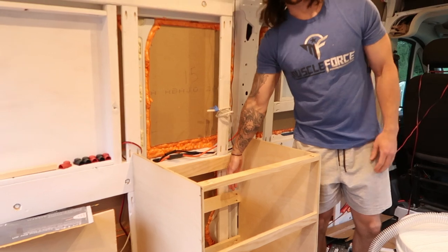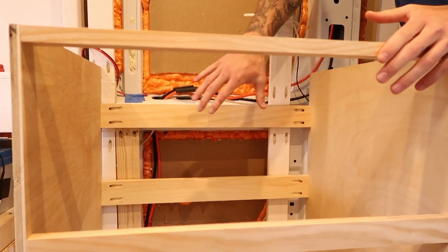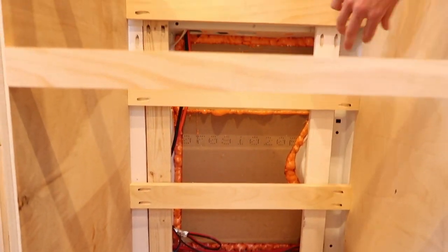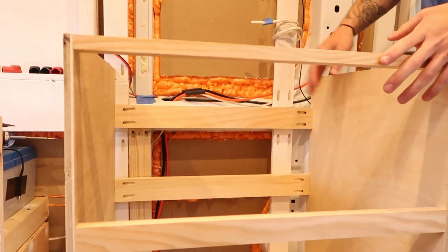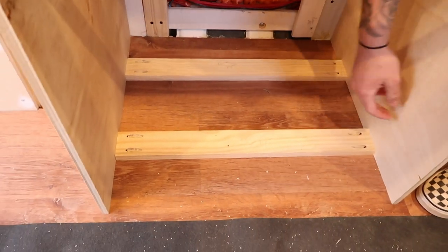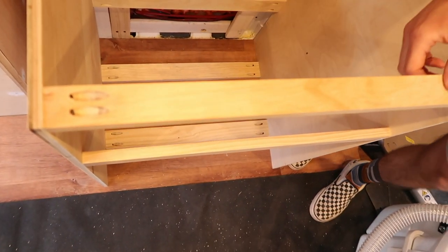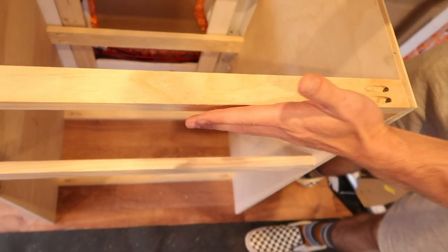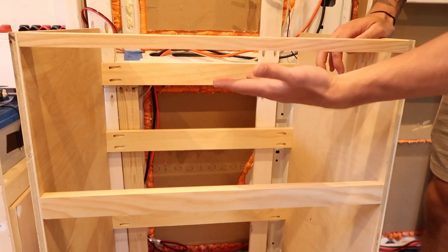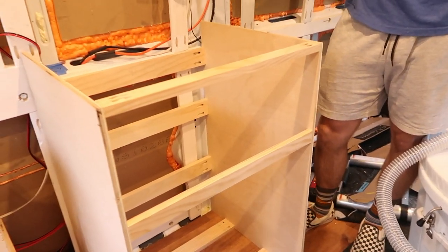Since we couldn't do the back plywood, we wanted to make sure it would still keep the shape and be strong. So we mounted three one by threes on the back, and these will be able to go into our furring strips all the way up and down. We also did two more one by threes on the bottom for structural soundness. And then up here we have just a one by three for kind of a backer for the top drawer when the time comes, and a lot more support for the counter. This is the divider between the bottom and the top set of drawers, so the drawers will have enough room to come rest here.